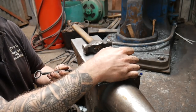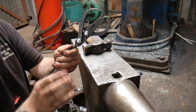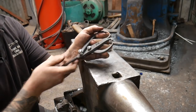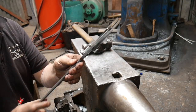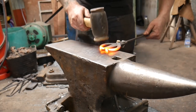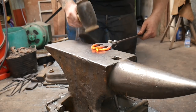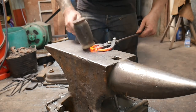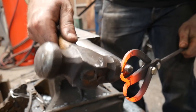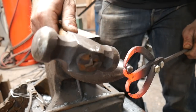I'm going to heat up just the very ends of the calipers, being careful not to burn them, then use a soft mallet to tap them so they all line up nicely. It doesn't matter if they're a bit bent and off-center — that's exactly what this is for. Then I'll use my hand hammer to tidy things up. This should set up as a really nice set of calipers — I'm really pleased with them.